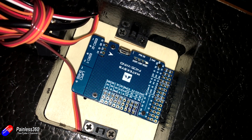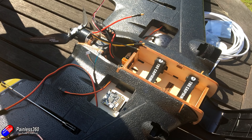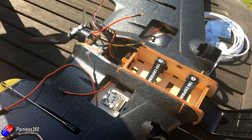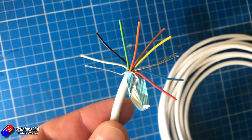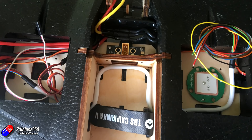First I spent time figuring out how all the routing and cabling in this wing works. There are two equipment bays with clickable latches on top, and bays underneath the wing — one for the video transmitter and one for the radio receiver. The cameras go at the front and all of that has to be connected. I didn't want to run lots of signal cables near all the high-power electronics at the back where the ESC is, so I decided to get a multi-strand shielded cable to carry signals and power between bays, giving the signals the best chance of avoiding RF and electrical noise interference.